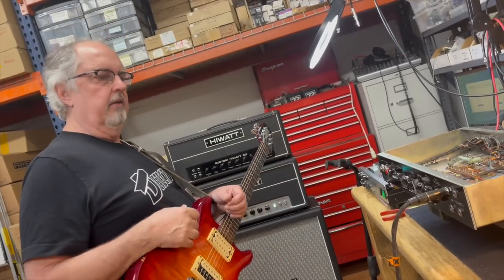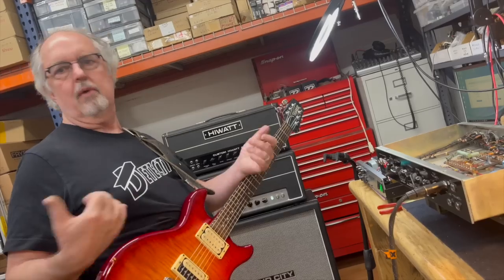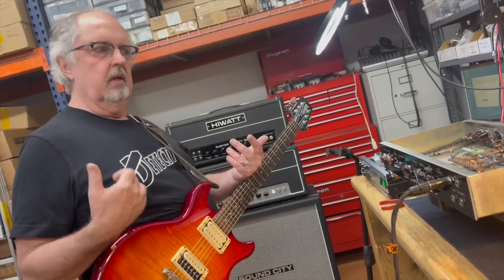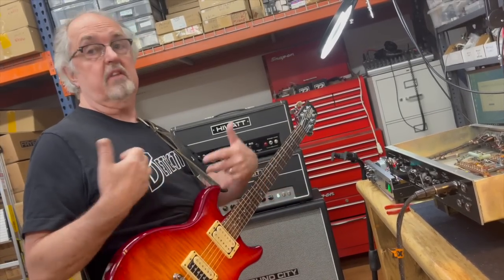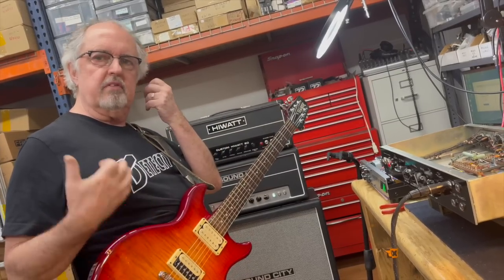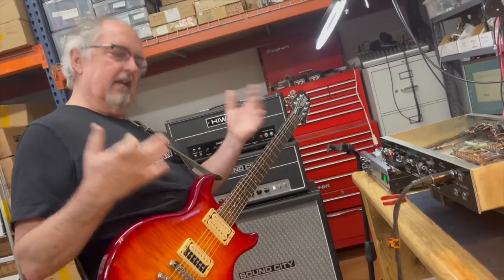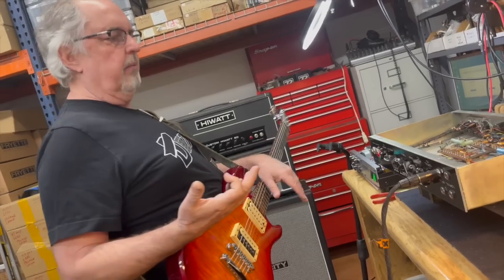Yeah. And for the amps that used EL34s rather than 6L6s, that was just kind of the fix. Sure. A big reason why Eddie used 6CA7s is because they were more reliable on the road. You couldn't get that many reliable EL34s at that time period. They blew all the time. That's why Marshall switched to the 6550s. Right, to get around that problem.